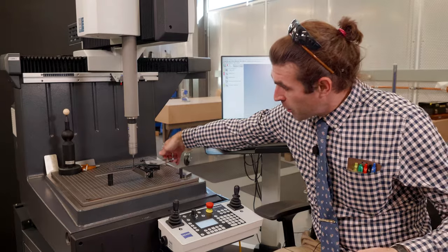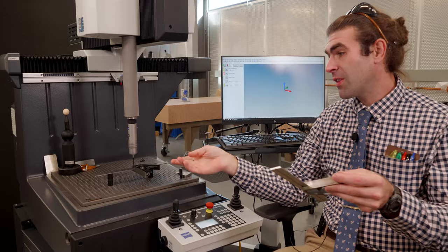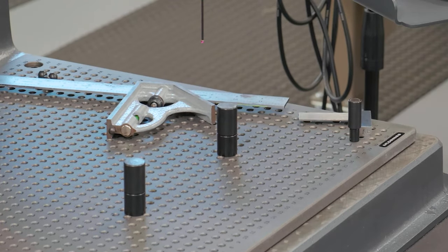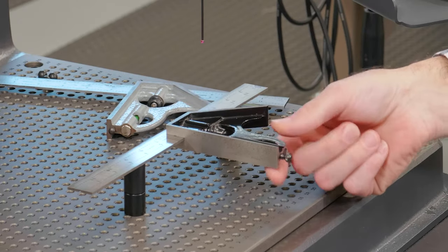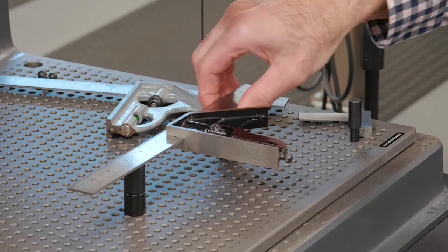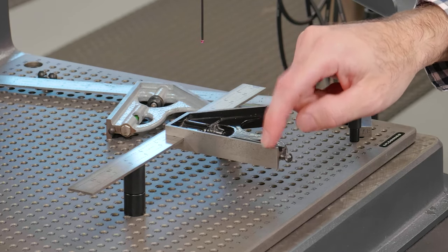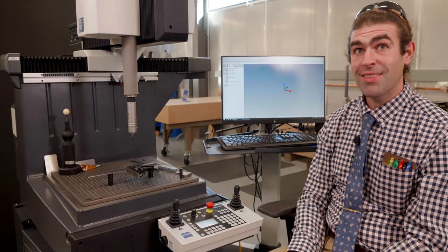We're just checking normal carpenter squares. I've got a Mitutoyo and then on the table is a Starrett. The setup uses little magnetic discs that fit on the table, they just screw right in, and the square pops right on. This looks a little weak as a setup, but this probe doesn't apply very much force at all. You could check it with your finger as long as the taps don't move it — the probe shouldn't move it either, so I'm happy enough with this setup.